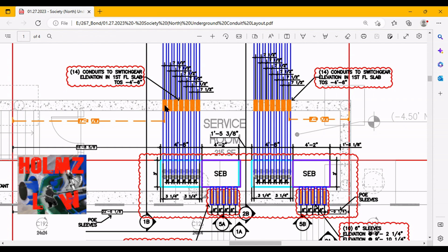Out in the field, the wall isn't there yet, but we have form boards which the concrete layers put up to form their wall. They'll have one side on, with rebar and whatnot, and open on one side so we can install our sleeves. To install a sleeve, I need to find that measurement — 17 feet and 2 and 1/8 inches for the center of my sleeve. The other measurement I need is the height, which I go off of a benchmark.